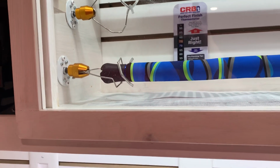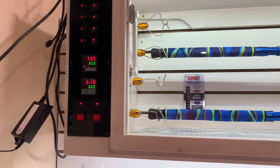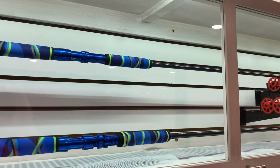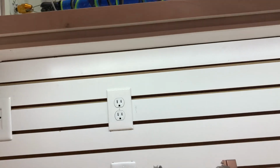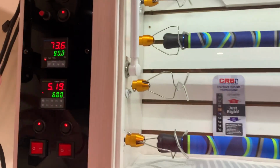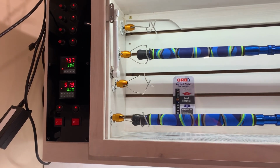But I have these guys set here, again, each individually controlled. Those are driven off of the link to the main timer. So again, at the end of the timer expiration, the whole thing would shut off. Have a little LED strip inside the box, also underneath the box to get a little more light on the bench. More light is always a good thing. Like I said, the thermostat control will bring that up to temperature, whatever it's set at there, and hold it nice and steady once it comes up to temp.